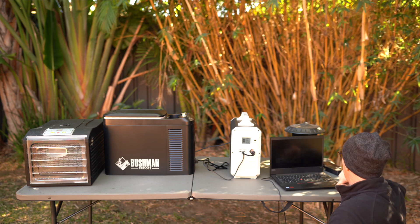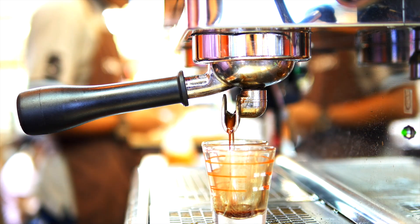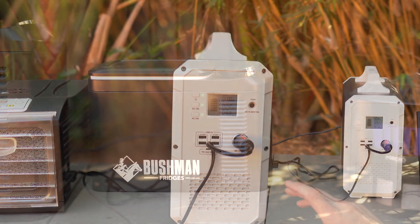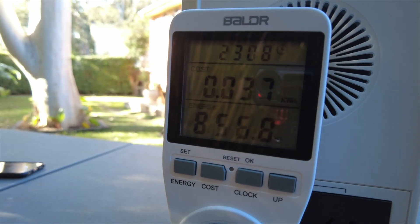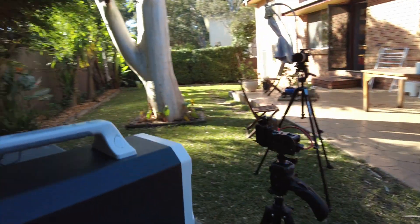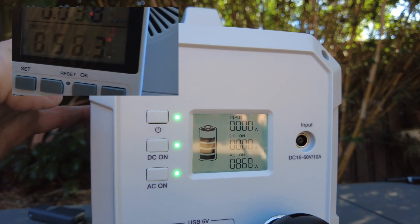1000 watts is not high enough to run high-powered devices like coffee machines or induction cooking plates, but it should be sufficient for most campers running their lights, fridges, and charging all their digital devices and cameras. When Will Prowse tested the EB150 in 2019, he noted quite a discrepancy between the AC wattage shown on the display and the actual output on a wattmeter. Bluetti has fixed that — my display correlated with the wattmeter on the AC plug and the difference was only a few watts.